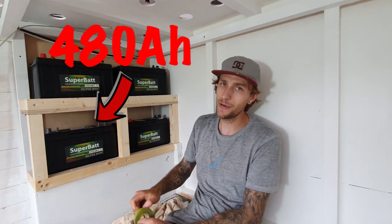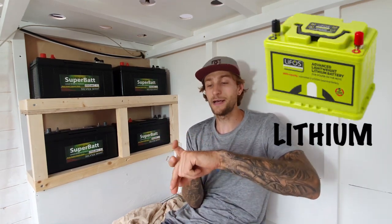I'll crack this video on with talking about battery power. The system I'm using is a VRLA 480 amp hour setup. When choosing the right battery system for you, there's lots to consider. The first thing is type of battery — there are three main types. The first one is lithium battery technology, which by far is the best technology out there. It's almost 100% efficient, completely sealed cells and completely maintenance free, but the downside is they are about 10 times more expensive than the VRLA setup.